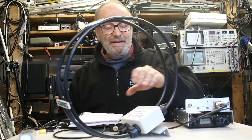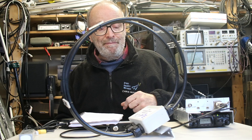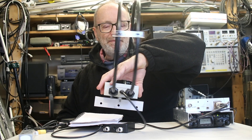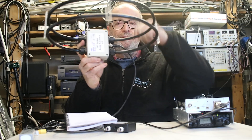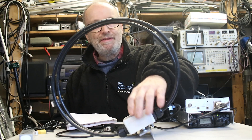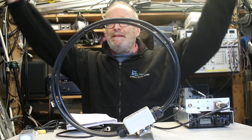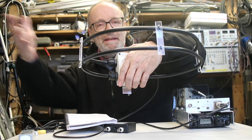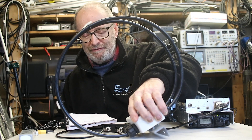What's the antenna pattern? Mounted like this, as you've seen in the demonstration, it has two very sharp nulls on either side — the null is pointing to the camera now, turned 90 degrees it's maximum signal. Mounted horizontally it's omnidirectional, with two nulls — one going up, one going down. Mounted vertically it's an ideal NVIS antenna because the reception pattern goes straight up and around. Mounted horizontally higher up, you get a lower angle pattern, but with nulls going straight up, so it's not as good for NVIS work.